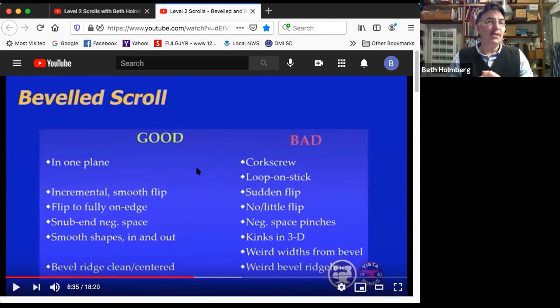Then take another one of your pieces of paper and fold it not perfectly perpendicular. Fold it like one of those angles we saw. Fold the other one like the other angle, from the tip down, little teeny folds. This is a great Mark Aspery trick. Those two other guys, the badly folded ones, will help you to figure out what you did wrong by giving you something that you can compare to. Say, oh, I got the corkscrew, so that means I had the angle this way. Really great way of troubleshooting.